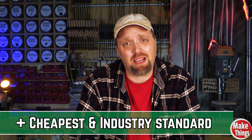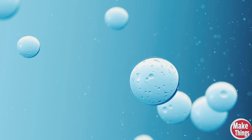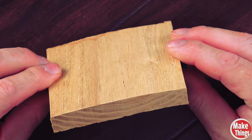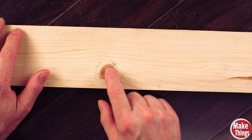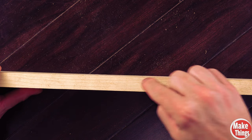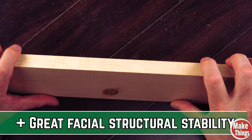The stability of this wood is a bit of a mixed bag. This is the most unstable sawn method — lumber cut this way is more likely to cup, twist, or bow due to the open tangential grains. Moisture permeability means it accepts and releases more moisture, which means more movement. Boards cut this way cup in the opposite direction due to growth rings, as the face closest to the outside of the tree dries quicker. Interestingly, even though there's a knot on the face of a plain sawn board, it's actually far more stable than if it were quarter sawn — the equivalent of having a knot through the side. In construction, all wood is done in this method because it's much more structurally sturdy.